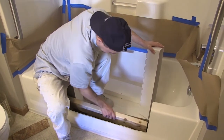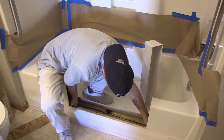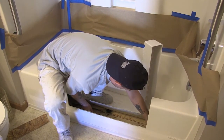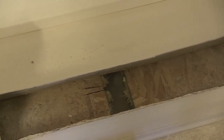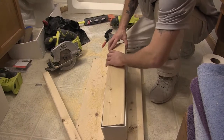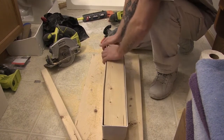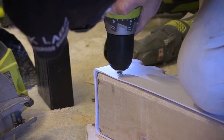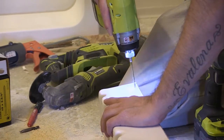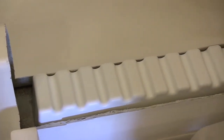Build the support box structure to the appropriate height. If working with a wooden subfloor, begin by screwing or gluing a treated 2x4 directly to the subfloor to serve as the base for the support. Remove any materials from the subfloor that may cause an uneven surface. Prior to inserting the small support box, secure a 22-and-a-half-inch long 2x4 into the channel of the small support box. Place several screws into the small support box to properly adhere the 2x4 in place — it may be necessary to pre-drill some holes. Insert the small box in the channel, but at this point do not adhere the small support box to anything.